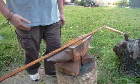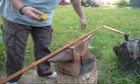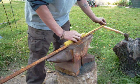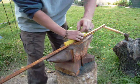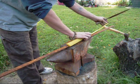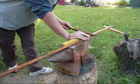So before we can get this piece in the fire and get it ready, we need to lay it out first. So to do that, we got to measure everything out. So take your handy dandy ruler and whatever length you're going to be comfortable working with. Now for me, I'm going to go at a 14-inch length total. So to mark that for cut, lay that up next to it there. Find your 14-inch mark.